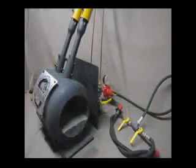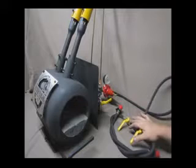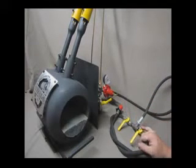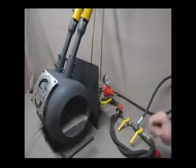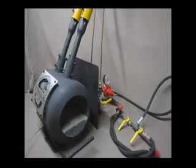Safety. When it comes to safety with regards to the forge, obviously we're running with sealed plumbing. All of the parts used on the forge are SABS approved. What we need to do is regularly, and I prefer to do this before I run my forge on a daily basis, I would refer to the operating instructions for the leak detection mixture. And I find that a commercial leak detector works very, very well of the spray type. The one that you mix with water works tremendously well, because it comes in a spray can, a spray format.